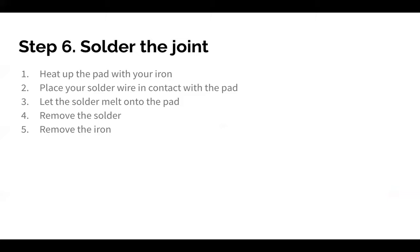And then when you feed your solder in, it's going to melt, and it's basically just going to be attracted to the hottest spot that it's near. So it might just go under your soldering iron, but then eventually gravity will let it fall. And then you'll fill up the little hole, and it's very satisfying when you do it right. And all of you guys are gonna feel that satisfaction today. Okay, and then once you've done, yes.